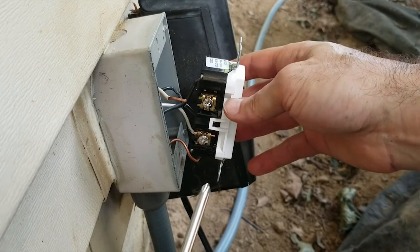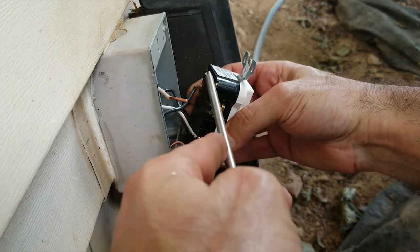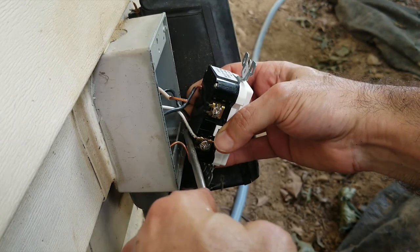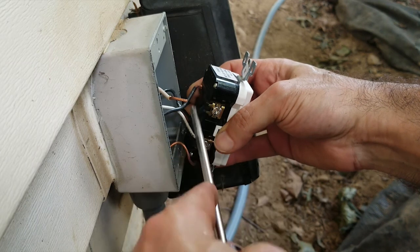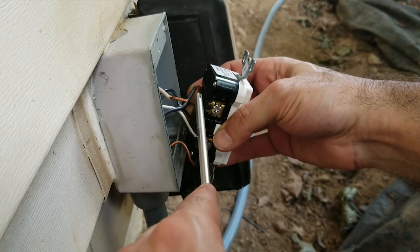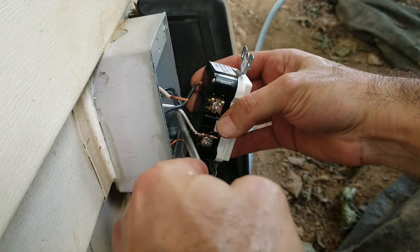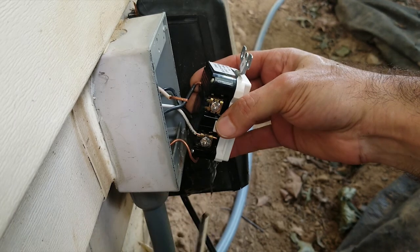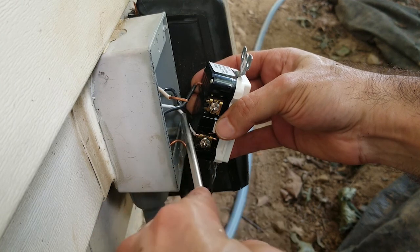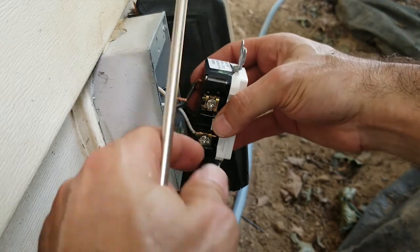As I make the final connection, I want to make a quick note on GFCI outlets. They typically have two sets of terminals — one side is the line and the other side is the load. The line side is where your feed comes in. The load side is what's going to be protected by the GFCI. So not only are the two outlets protected, but anything connected to the load side terminals. By having this conduit fed by the load side, anything downstream will also be protected. If there happens to be more current flowing through the hot than through the neutral — which could indicate a leak to ground somewhere — the GFCI will trip and protect what's downstream.